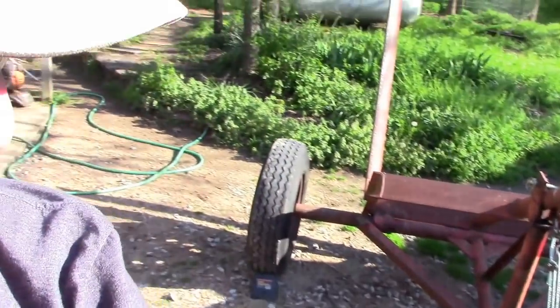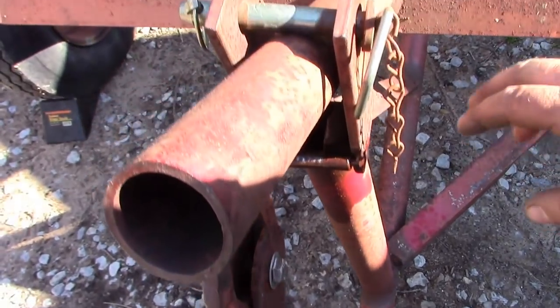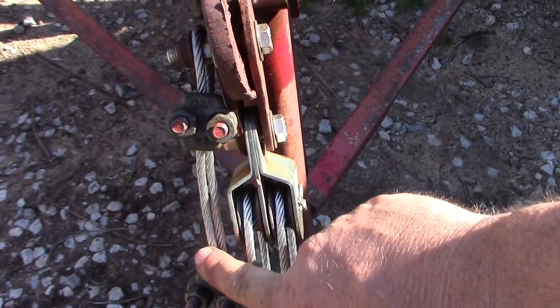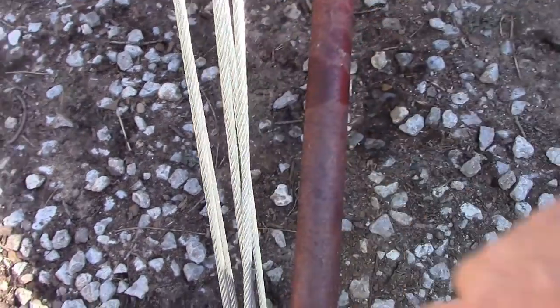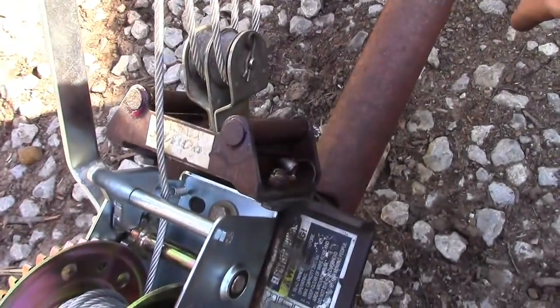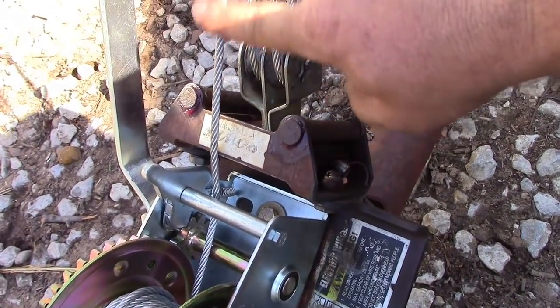It cranked up okay. Let me show you what it looks like in the stowed position. This is your travel pin — you have this installed so all the weight is not carried on these cables. Cables are only for going up and down, so when it's actually carrying a load, have the travel pin in there. You can see the actual stop block or anchor point, and all the cables are nice and neat. Looking at this, I probably should have run this cable down through here versus on top — I didn't know what the angle would be in the stowed position so I took a guess. I guessed wrong. So this should actually be underneath. On another day I'll undo these and re-rig them.